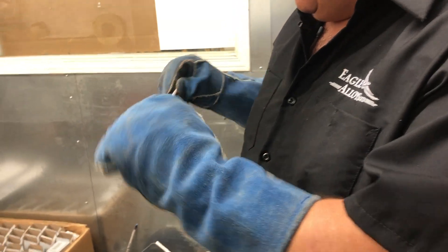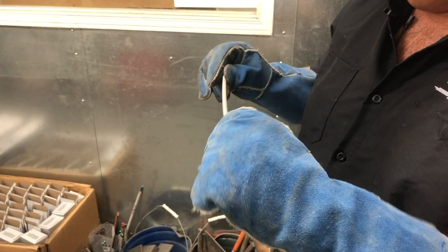This is moisture-resistant coated — it won't absorb moisture. Is it an all-position rod? Yeah, it's all position. It'll weld flat, horizontal, overhead — you name it.